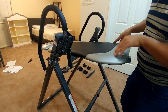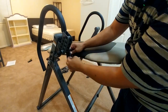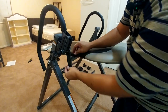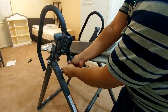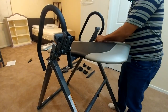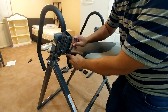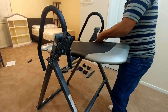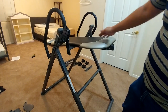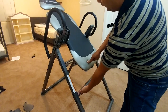The backrest is going to be moving, but since you have the pin it will stay in place. Put the washer and lock nut in — same thing on the bottom: the washer, stop washer, and lock nut. When you install this, make sure that the bottom of the backrest is on the end where the crossbar is.